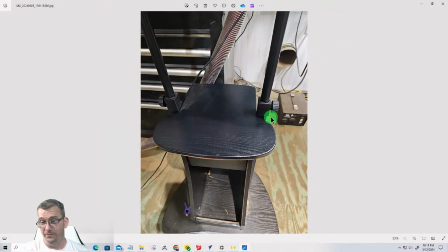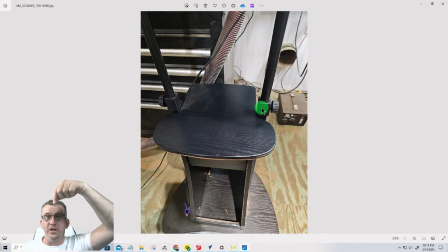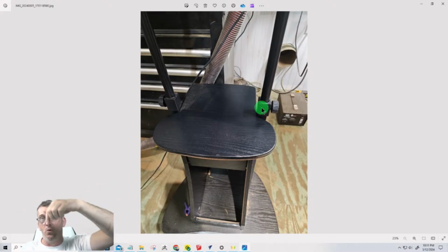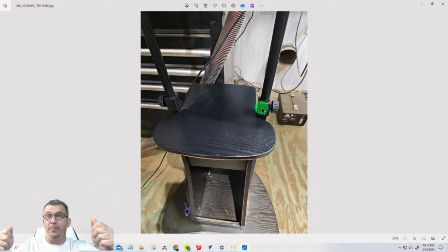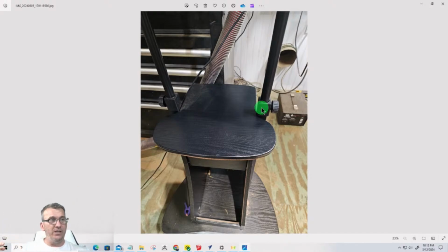Now, Roger or JR, if you wanted to, on this 1 7/8 inch dowel, think about this now. If you wanted to create kind of a V-shaped jig, even out of a 2x4, you could take a 90-degree V-bit or whatever and cut it kind of a V shape, here, so that dowel can lay in there, on your table and clamp it down. You could come in and drill with your CNC a series of holes and put threaded inserts in there. So you have kind of positive stops almost, to where when you slide this up, you've got a place, at certain heights. Right now it's a friction, right? So this is raising up, those are screwing in, and it's pushing in against it, keeping it from dropping down. Now I'm using wooden dowels, right?